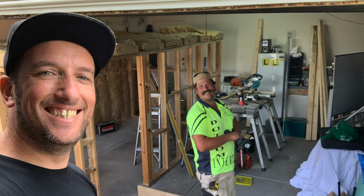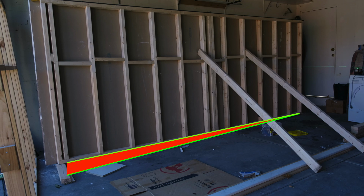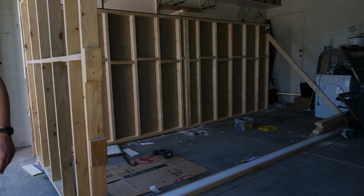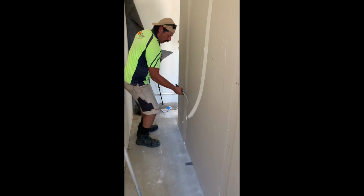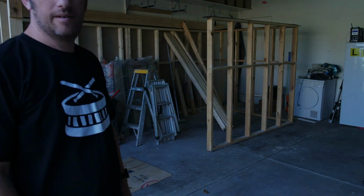Now, I've got to give it up for my brother-in-law, Emil. He is a builder by trade and has an incredible eye for the tiny details. The first part of the rebuild was to construct the frame that went up against the back wall and one of the side frames. Now, with my garage, there is roughly a 50mm drop from the back to the front. It was important that we make the frame as level as possible, so we needed to fill out the bottom with packers and spare timber. Once this was done, we finished plastering the wall side, then shifted the whole frame against the wall.